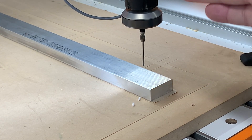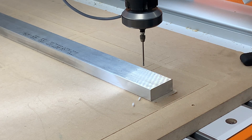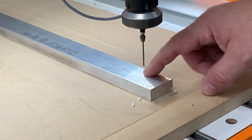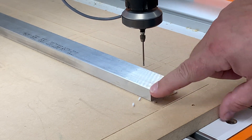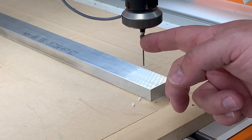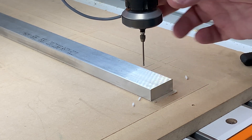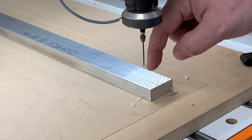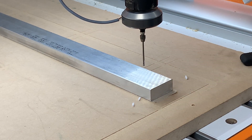Anytime I use it, it's perfectly aligned with the center of the spindle, so whatever measurement it gives me in this corner is going to be accurate no matter what size end mill I use. What I'm trying to do here is put some holes in an aluminum bar. I set my job up to have the XY datum on the lower left-hand corner, which means the center of this touch probe needs to be exactly on the corner, so any other bit I put in the machine is perfectly aligned with that starting point and all holes will be placed based on that exact corner location.